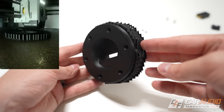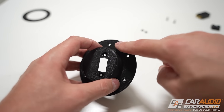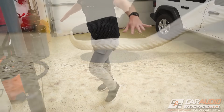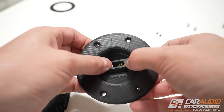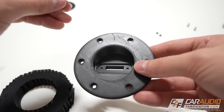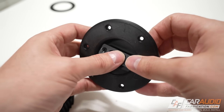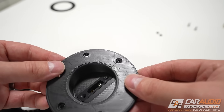Here is revision one off of the machine — I've already separated it from the support material. The first thing I've got to test is the strength. Let's give this the weight test and see if it can support my body weight — no problems there, a few scratches though. Let's check the fitment of the XT90 — it actually fits really good, a nice tight fit. It's not mounted yet but it takes a little bit of strength to pull out, so I'm happy with that. I also like that we can reverse this to have the lettering the correct way up depending on the orientation. Let's check the fitment of one of our number six mounting screws — nice, it sits below the surface and has no problem going through the hole while still being a little bit tight.